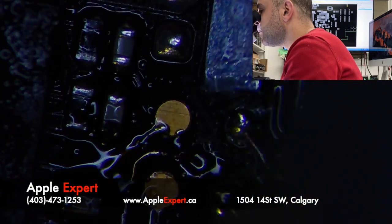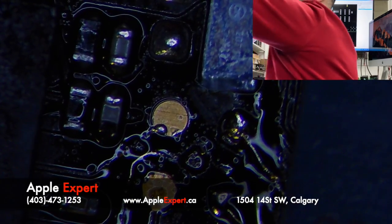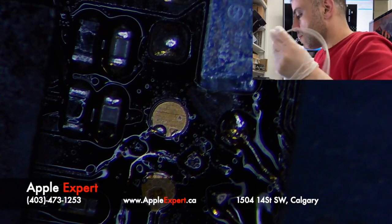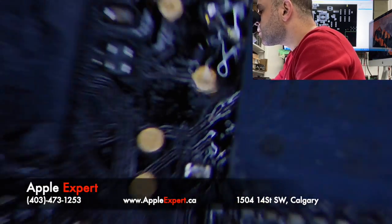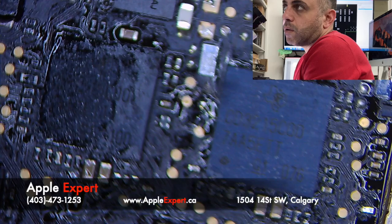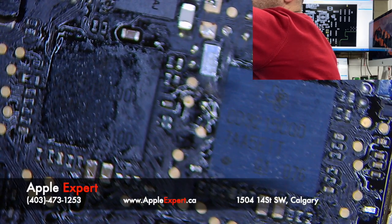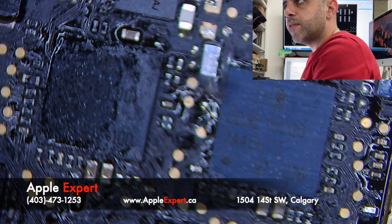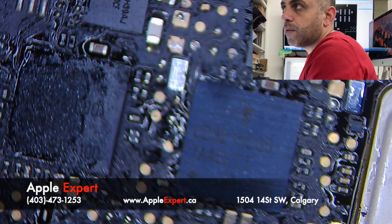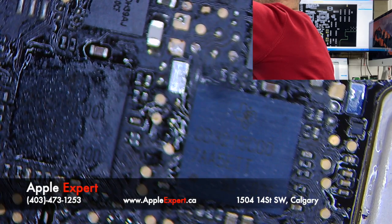So what I will do to make it easier on me, let me try to see what I get when I connect 5 volts, when I connect it to my charger. I get 5.2 volts, 0.15 amp on this port. And I get here 5.2, 0.38 amp. Interesting.